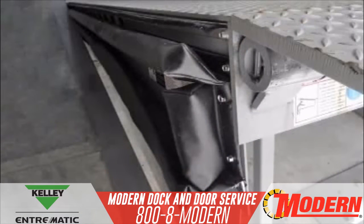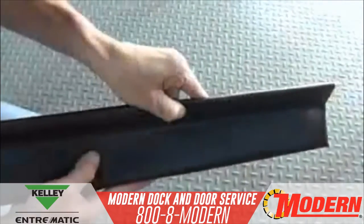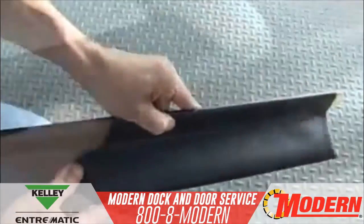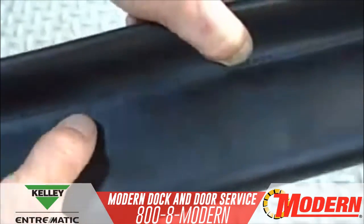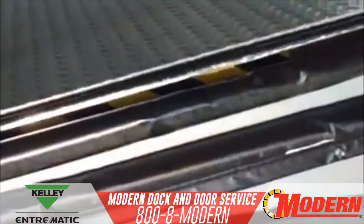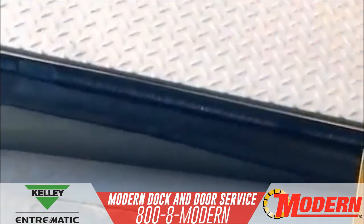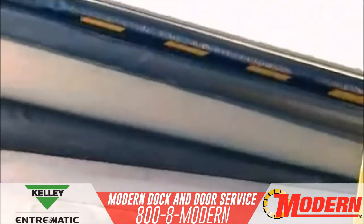The vertical front side seal prevents airflow from under the overhead door when closed. The side seals are constructed of open cell foam, encapsulated with reinforced vinyl, and are designed for durability as they pivot along the pit wall. Testing confirms that after 50,000 cycles, the heavy-duty fabric shows minimal wear.